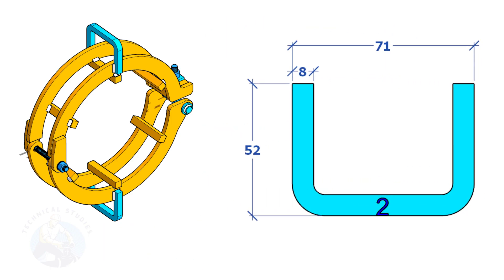For item number two, you can use square bar, round bar, or whatever material is suitable for a handle. The size shall be 6 millimeters to 10 millimeters. For up to 6-inch clamps, one handle is enough.